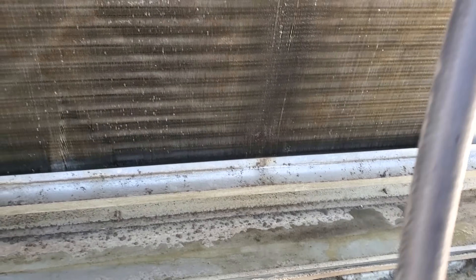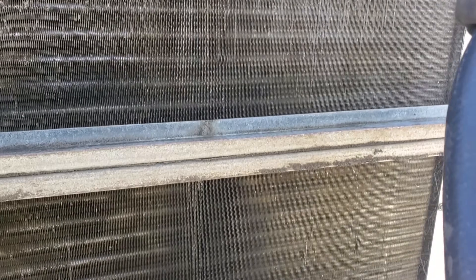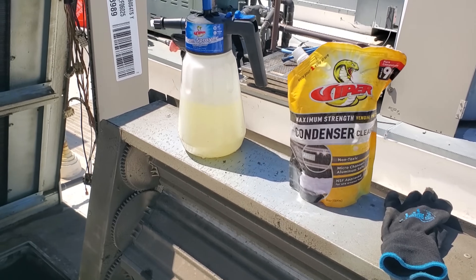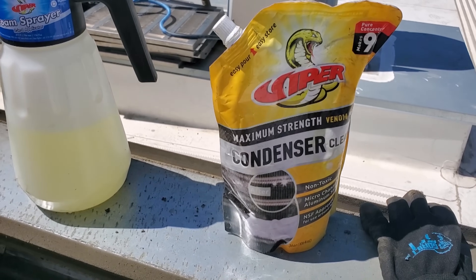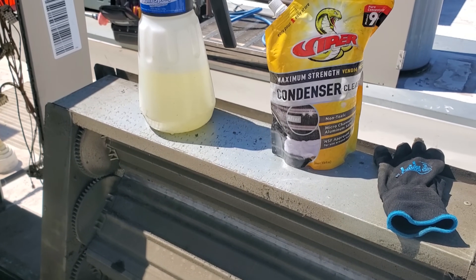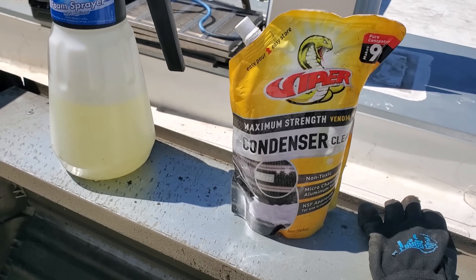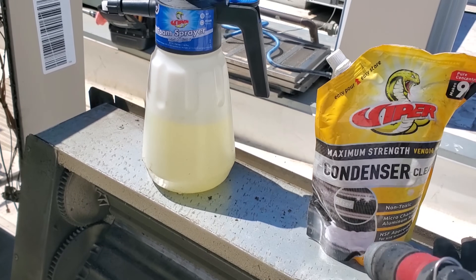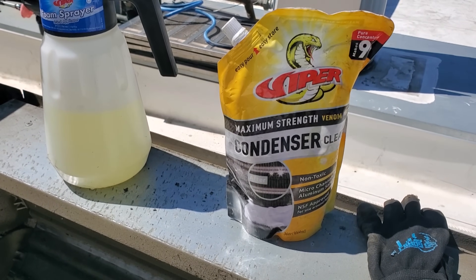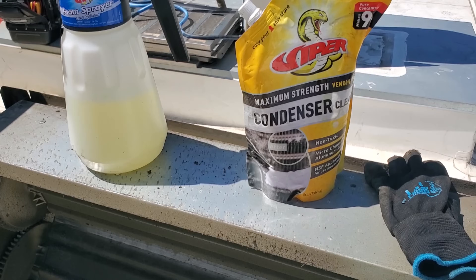What I'm talking about is how the water will rain off the coil — that's not raining off the coil, that's going straight down the drain pan. We want to make sure we've got a nice saturated coil. Once we do that, we can apply the coil cleaner. Today we're going to be using the Refrigeration Technologies Viper condenser coil cleaner. Now, this is condenser coil cleaner, but it's safe on evaporators too. I have the normal evaporator coil cleaner, but I just wanted to bring one bag on the roof — this is perfectly safe to use on evaporators. In fact, if you mix it correctly and you use it on the evaporator, technically you don't have to rinse it because it's not corrosive and the condensation from the evaporator would rinse it. But in my situation, we're going to rinse.